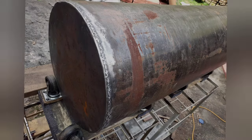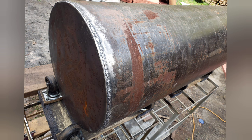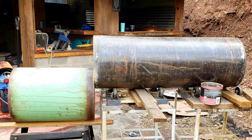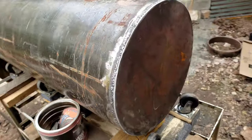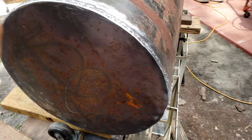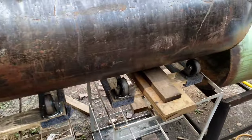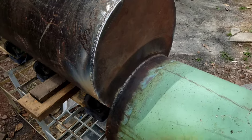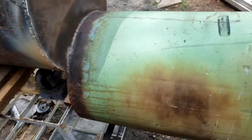Now that I got it shortened up, you can see I got a really nice bevel put on there. Got the end cap welded up — I had to lay a nice root weld and then a weld over top of it, just to make it nice and sturdy. Got the cook chamber attached, everything is capped off. And I'm going to be putting the elbow on for the chimney here pretty soon, right after I weld up the bottom of the firebox.